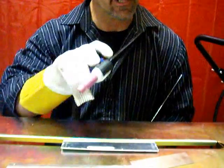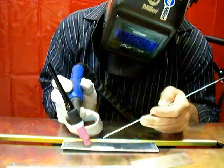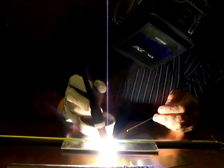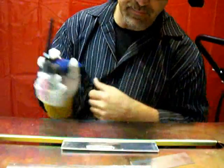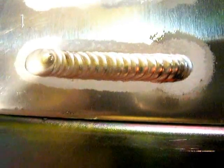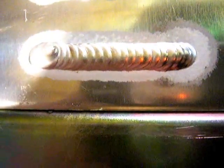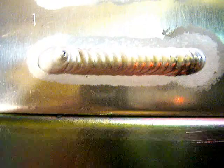I've got the switch hooked in — you should be able to hear the argon. No amperage control, just the torch switch. Plenty of cleaning action at 65 on the AC balance and about 100 hertz on the AC frequency. Got it set to down-slope a little bit.